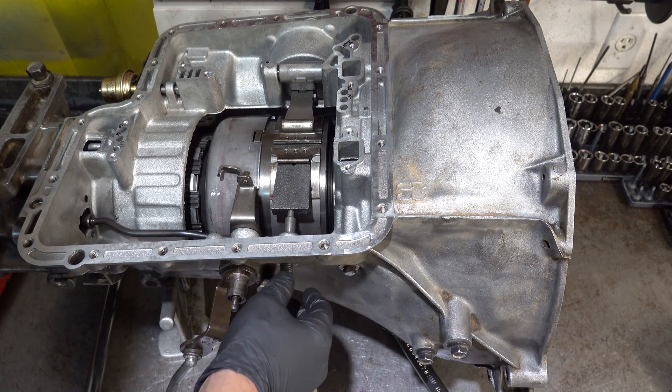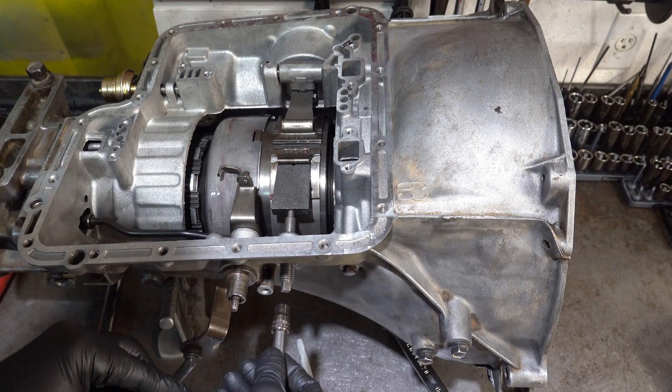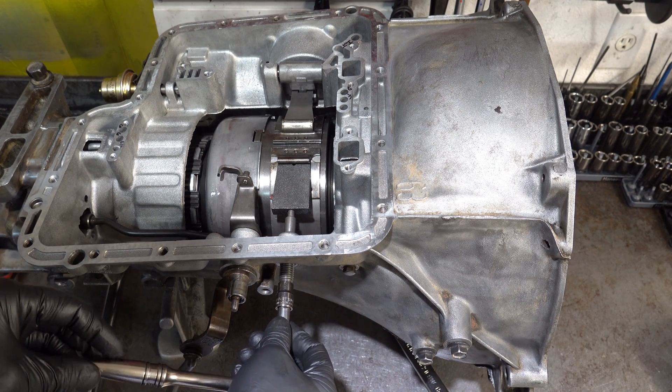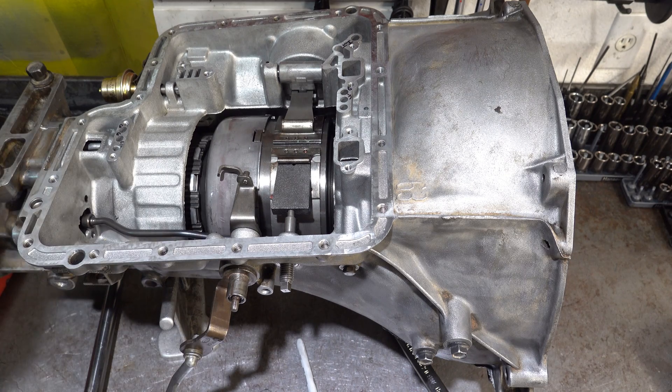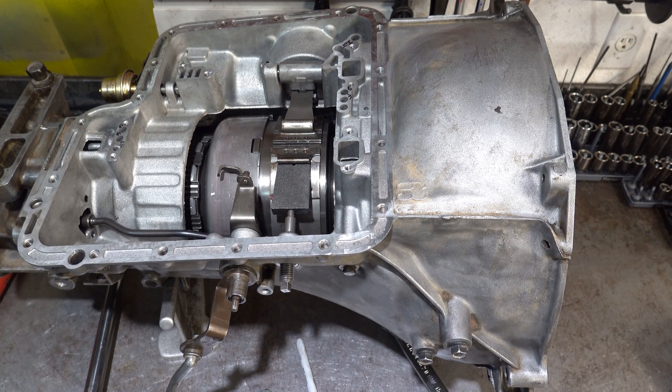Keeping that in mind, I'm actually going to rotate it back that eighth of a turn. There really isn't a difference and it is rotating just fine - I'm not feeling any kind of binding or any indication that the band and the drum are bound up when it's like this.